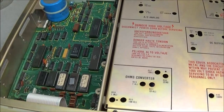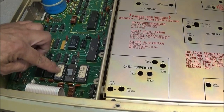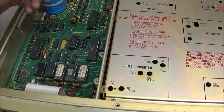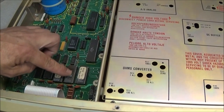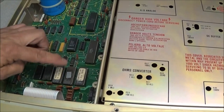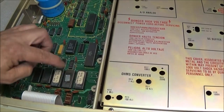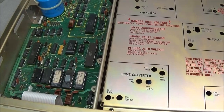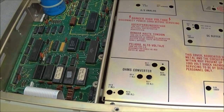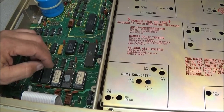The first thing I noticed when I took this off — there are three EPROMs, these look like 2764 series. Under these EPROMs there's a little window, and both of the tabs covering the windows have fallen off and are just laying inside the unit. I can't find one of them — it may be up under the power supply. These chips are erased by ultraviolet light, so I stuck the labels back on and put a little piece of gray tape over this one to keep any light from getting in and erasing the chips.